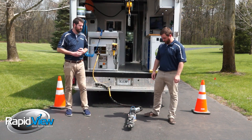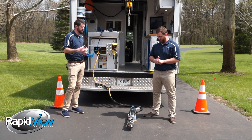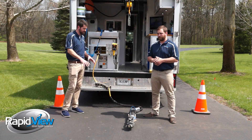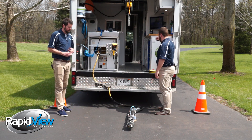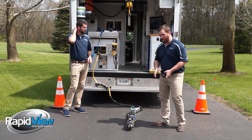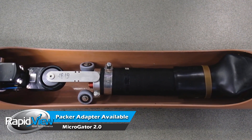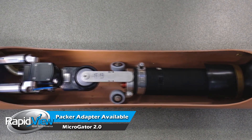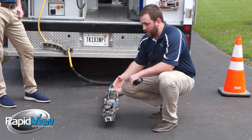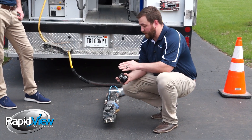Every now and then we do point repairs as well as pull packers in for top hat situations. Is there any kind of attachment to pull in a packer with this cutter? We have a packer adapter piece — you remove the front motor on this cutter. Do we lose our front camera when doing that? You'll still have two cameras: there's a camera on the front of the packer adapter, and you also have the camera that was your cutting view. This gives the operator the ability to move those packers within the pipe and still be able to see.